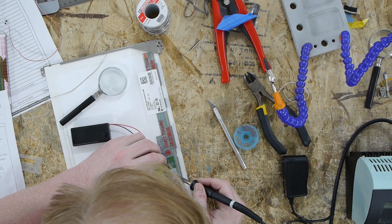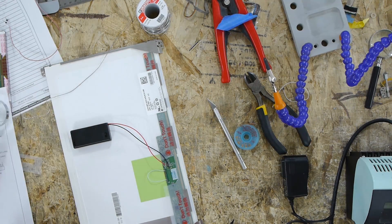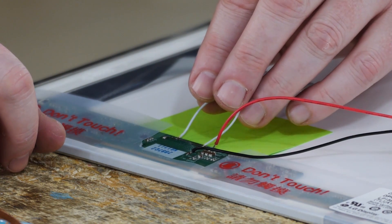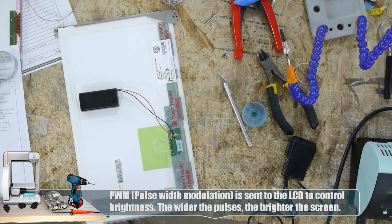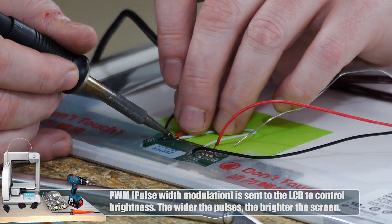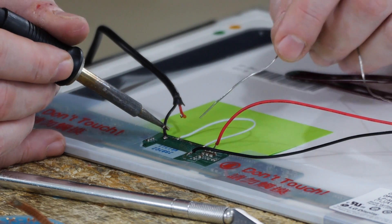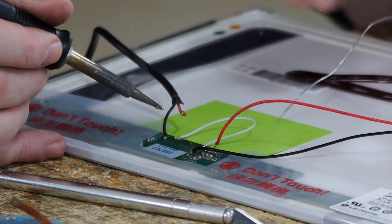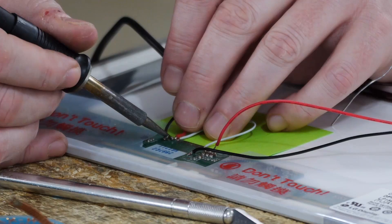That's good! I've got this battery pack here attached to the power supply, which I think we need in order for the logic to work. I've also connected that to the PWM for luminance control and the backlight on-off control. The backlight on is a high signal, and the PWM we'll just turn completely on as well. So this may work — as long as this screen works. If the LCD is dead though, this won't work.